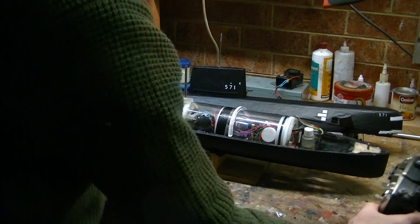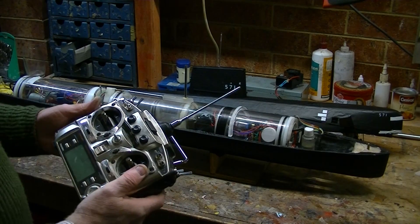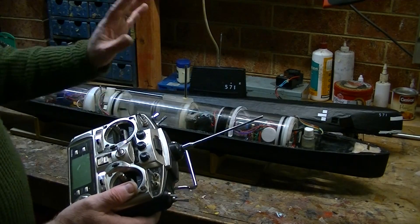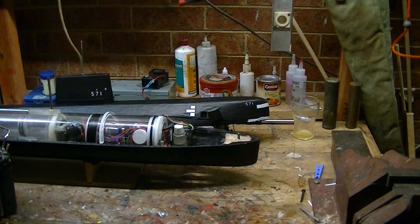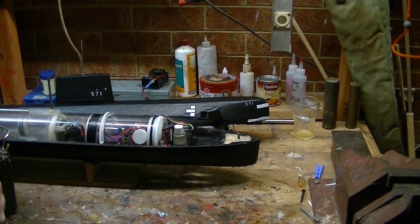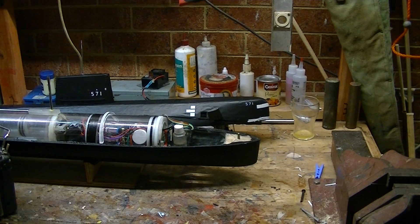At the same time it's quite complicated to use. With a standard RC I can control all of those functions independently, and that's fine — but to sail it on the water and control all of that is not quite so fine. There's another component I've added in terms of the programming: the bow hydroplanes, which close up and open out and operate when they're open. That was quite a challenge to work — there's quite a mechanism sitting under there with two servos to operate them, but the Arduino actually controls them also in a number of different ways.